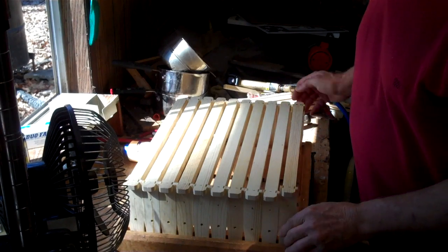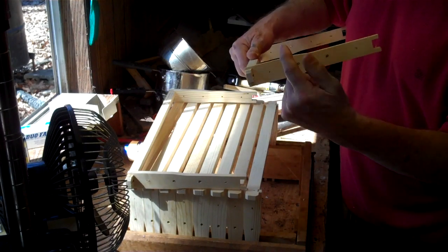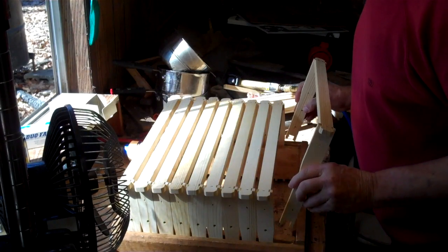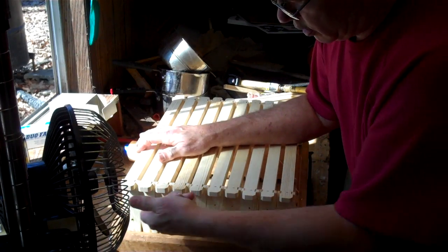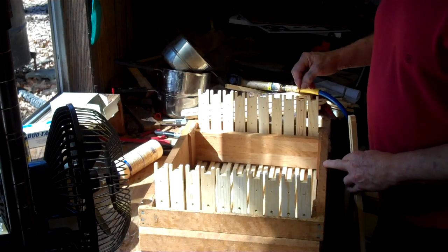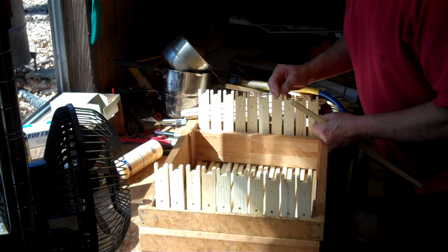The next step is, when you apply the glue and attach the top bar, you're going to have some glue squash out under the top bar. I want to wipe that clean — I can do it while it's still in the frame holder. I'll go underneath there with my fingernail and wipe out the glue that has squashed out. I have turned these frames upside down and applied glue to the bottom end of the end bars, and I'm going to spread that glue with a nail to distribute it more equally.